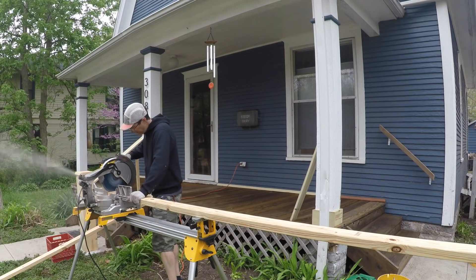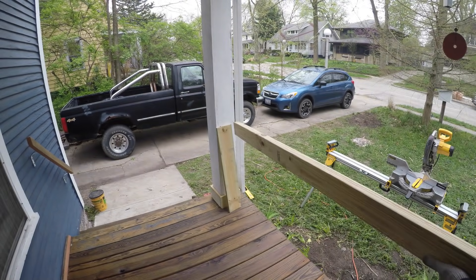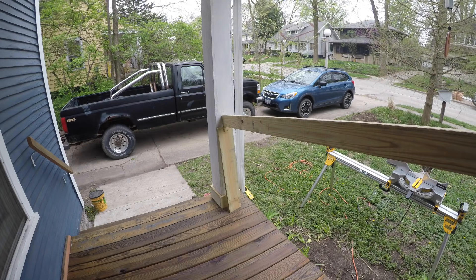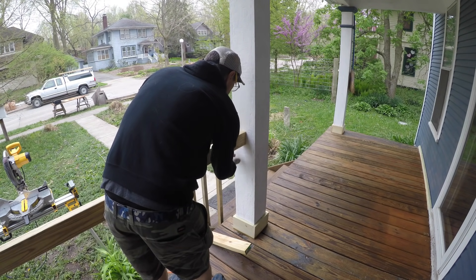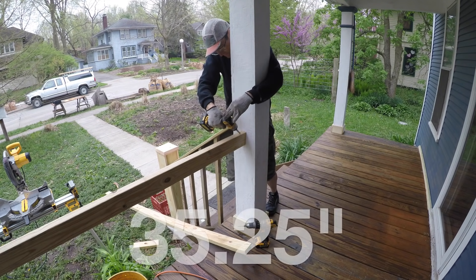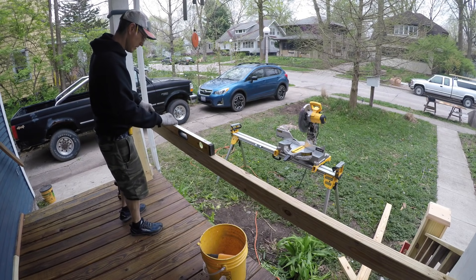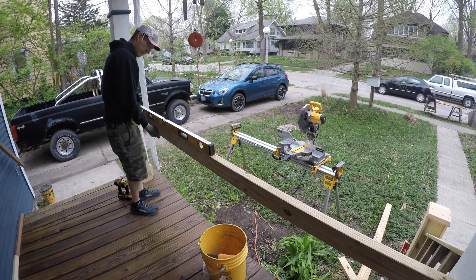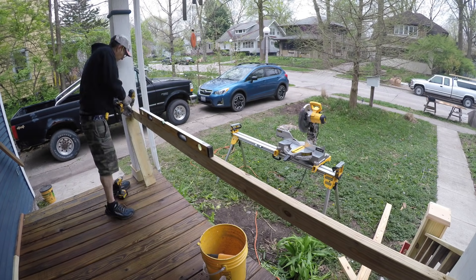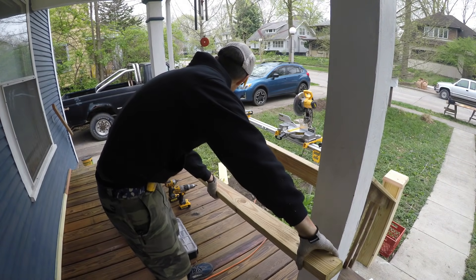This railing is really simple and easy to build. The 2x4 on top is placed vertically so it's a little bit stronger. Building this alone, I just used a piece of scrap wood on one end to support it, then at the other end screwed it into my post at 35 and a quarter inches — that way I can have a three-quarter inch piece on top to hit the 36-inch mark. I leveled it up and screwed both ends, then added another 2x4 down below.